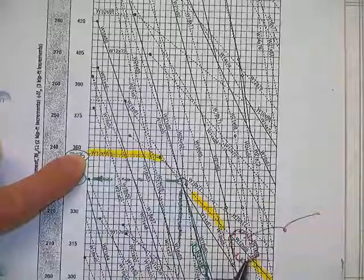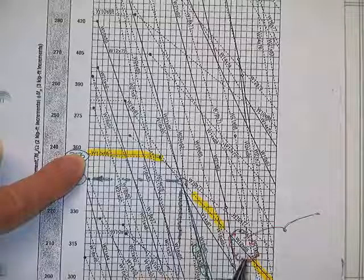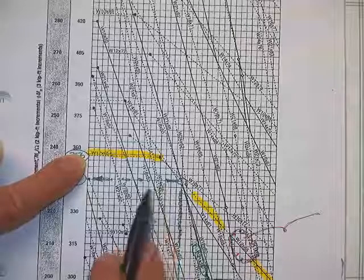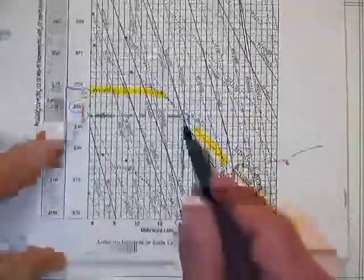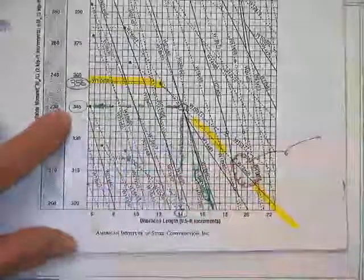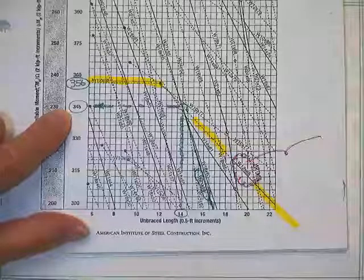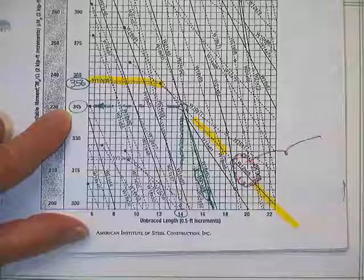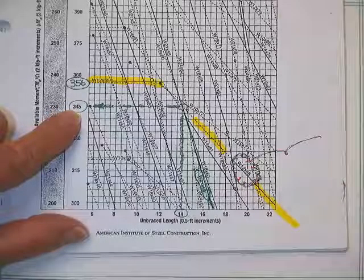Well, we're not using it as a beam. We're using a piece of it as a beam, but it's a beam column. So the fact that it doesn't show being lightest is not my problem. And I stop when the curve hits the 14-foot length, and I quickly get the bending strength, phi sub b, M sub n. I also think I got a Christmas present coming on lateral torsional buckling.